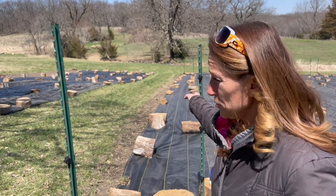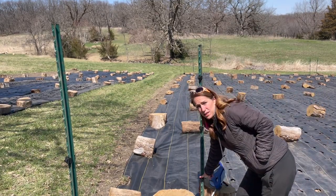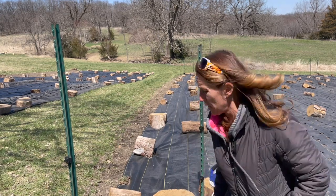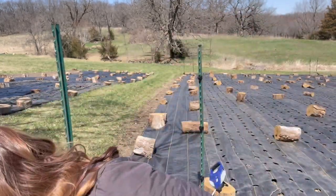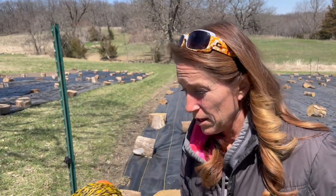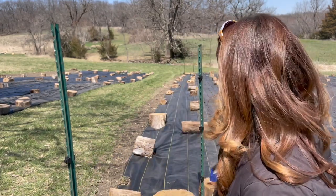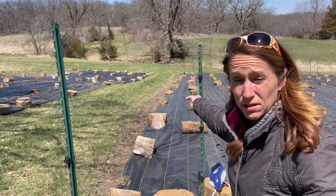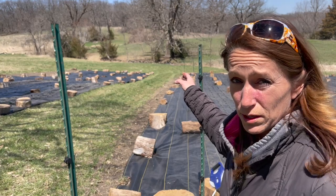It's a pretty simple concept. The inner fence has three lines. If you just want a quick reference, they are at 18 inches, 36 inches, and 54 inches. You run an electric string line — I use polywire wrapped up from last year. I'm reusing it again.